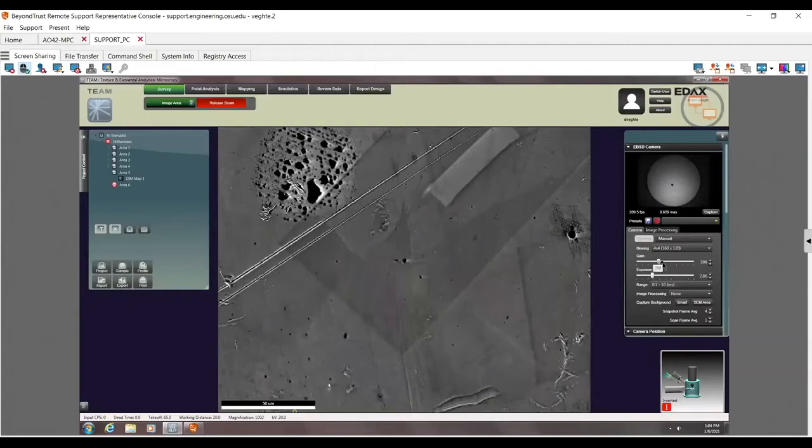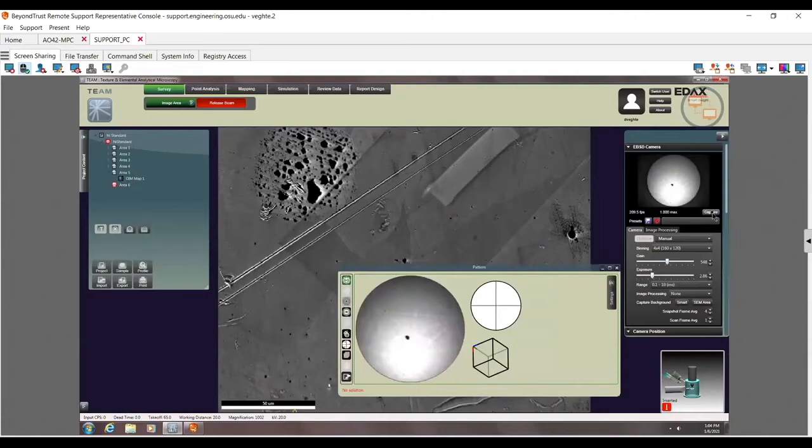Completely honest with you, let me go ahead and kind of prove it to you, without a background, without anything. This is oversaturated on about a quarter of the phosphor screen, and I'm going to assume this is probably going to be indexable. Boom. Look, no problem at all. Here you can see my CI is a little on the low side, my fit's not that great, but that's the correct orientation solution, because it doesn't need that information to do that. In fact, let's see what the Hough lines are finding.